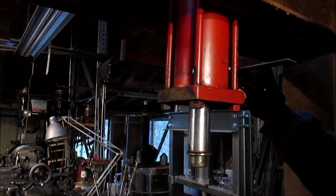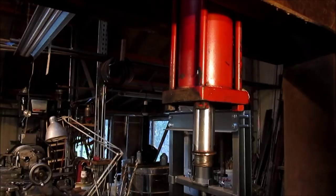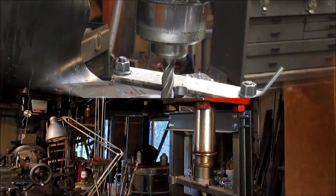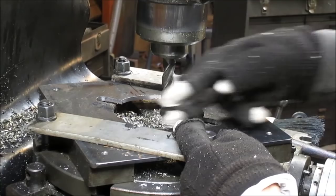And this side doesn't matter because the plate's going to slip on this way and it's going to bolt together like that. So, we've got about 30 thousandths to cut, so we'll go back over to the mill. Okay, so we're going to get the rotary table to rotate back over, and this is going to be our cut line right here. So, this is what we want to cut off,